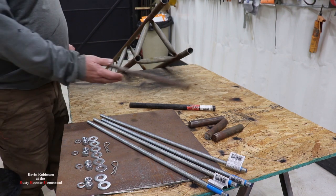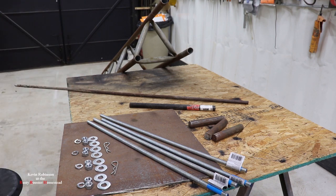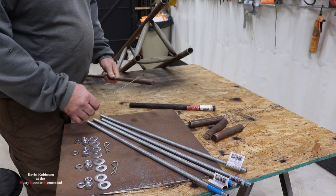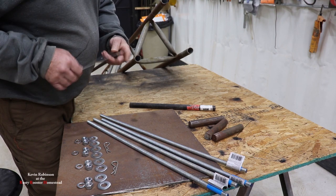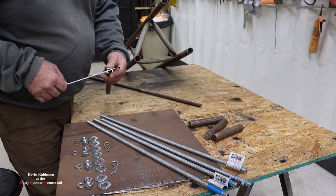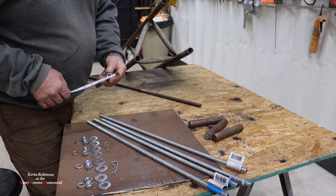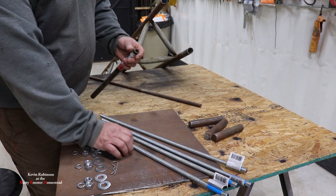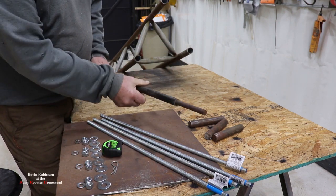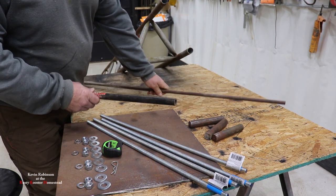And then you're going to need this piece of roof bolt. Let me get a tape measure here. Okay, we need this roof bolt as part of our hinge. Looks to be about 9/16 of an inch. And then we're going to need some black iron pipe. Now this is half inch black iron pipe, and that roof bolt at 9/16 will fit just inside of this. If you slide that in there, that's going to make us a nice heavy duty hinge to be able to get this tower up and down.